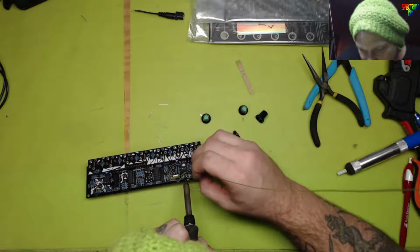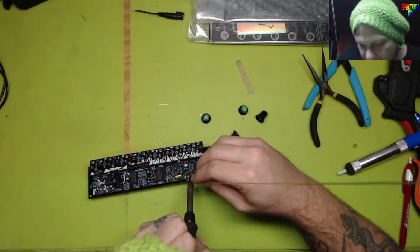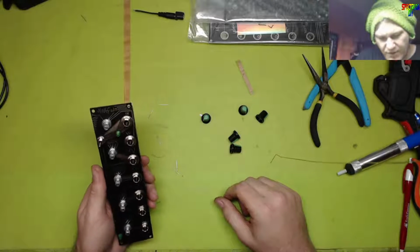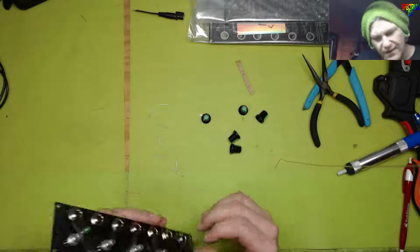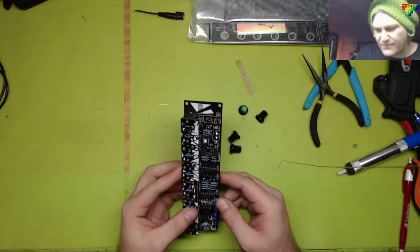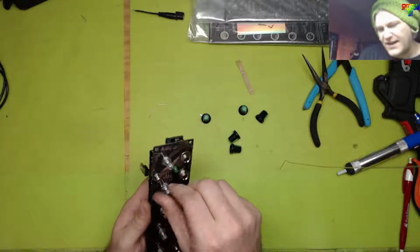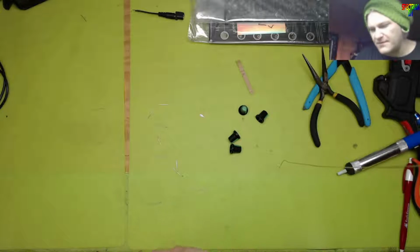And I want to make sure that that does have a good solid connection. But I'm talking, I could do a waveform in, like, one input, 4 CV outs, because you would use one oscillator. You would be using the output of one oscillator to tune the input of the rest of the oscillators, and then you would have to have their outputs. Well, you would do 5 inputs, and you could do 5 CV outputs, but only 4 of them would be useful. So, say 5 in, 4 out. Yeah, that seems reasonable.